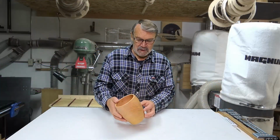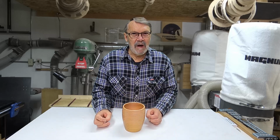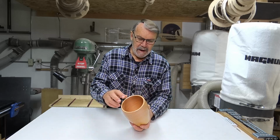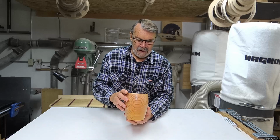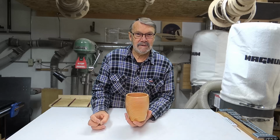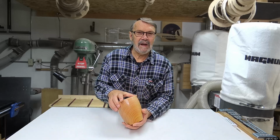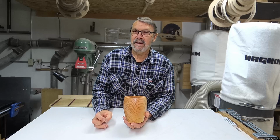Well, there's not too much more to say about this. This was not the most enjoyable turning I've ever done, but you know, it's better than not turning at all. And it's not horrible. I don't think I'll turn cedar again for a little while. But I certainly learned a lesson on using a mortise or a recess on the bottom instead of a tenon. I really don't like using tenons because it's another step to take care of later, but sometimes it's a better idea.